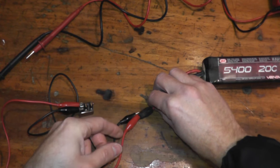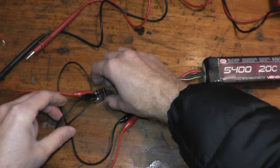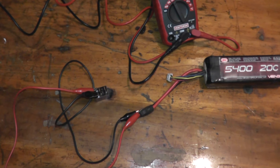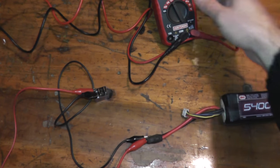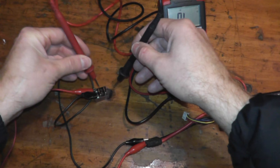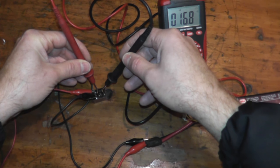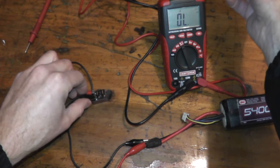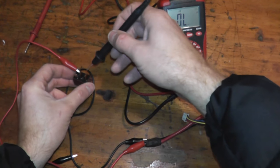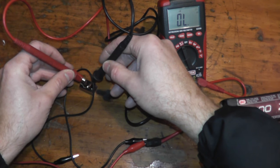Just want to be careful — make sure the wires don't cross. Now we test for continuity. We should hear an audible alert. Let me zoom out so you can see this — we'll also watch the numbers change. And there you go — this relay is working perfectly fine. If I disconnect this and test again, we should now have no continuity. And we don't.